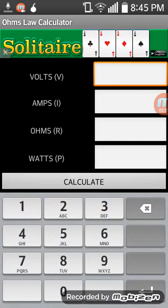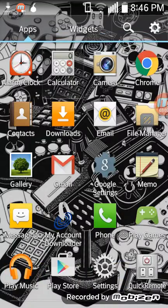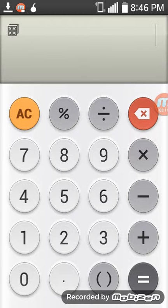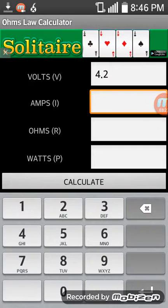Now, let's talk about the most common dual battery. Sorry if I'm not making much sense right now. It's kind of late. But, okay. So, a parallel dual 18650 mod. That would consist of still 4.2 volts. Let's say you kept the 35 amps, right? Well, 35 amps times 2, since you have 2 batteries, your amp limit gets doubled, because it's supposed to split the work between the batteries in half. So 35 times 2, 70. So now, let's say you have a 70 amp limit, supposedly. It's not completely safe to push 70, because we don't know that it's actually splitting the workload evenly.